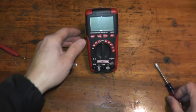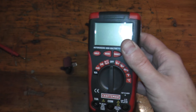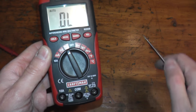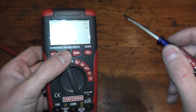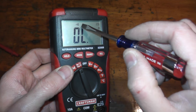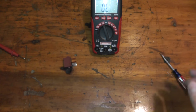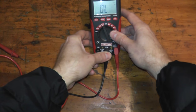So the question becomes: how do you test this? It's actually very simple, and we need a multimeter. You can do it without a multimeter using just a battery, but a multimeter really pinpoints if you have a problem. Don't be scared — they're very simple to use. You can pick them up for around 20 bucks at the local auto parts store, Amazon, or Home Depot. The function we want is continuity — you'll know you're on the right setting when you see the Wi-Fi hotspot symbol on the multimeter. Continuity just means two points make a connection, and when they do, we'll hear an audible alert.